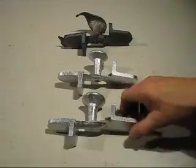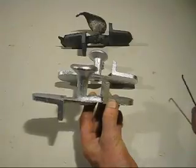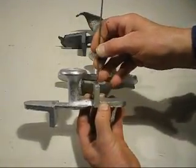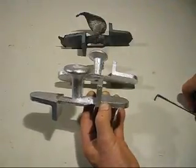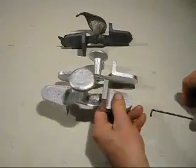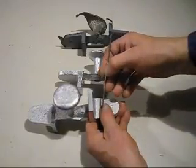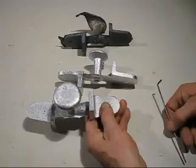About the other query — venting. I don't use venting at all in my moulds, and that's the reason why: it's a total waste of time. Most people think you've got to put something here or here and bleed the air out of that pocket. If your sand has enough porosity it does not need venting. Another thing people forget is if you stab a vent wire into a mould, all that sand in between is not vented — so it's a total waste of time.